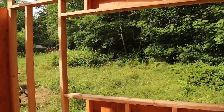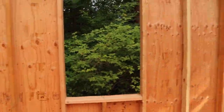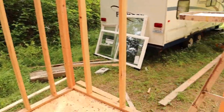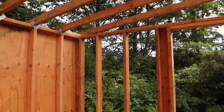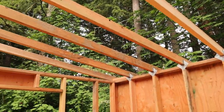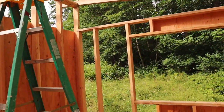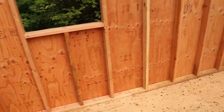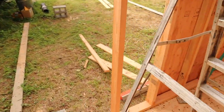It's pretty funny because when we did the rafters for our house they were 2x12s. We've got a great big window over the cutting table — it's going to be a pretty nice view. There's a smaller window here and another big window there. Going to put the slider here too. Tomorrow we'll put the roof plywood up, put some tar paper on it, then measure to order the metal roofing. Then we've got to put the rest of the plywood on the walls, put the windows in, do the electrical, insulation, and drywall, and it'll be done.